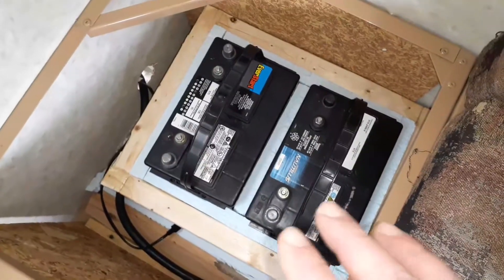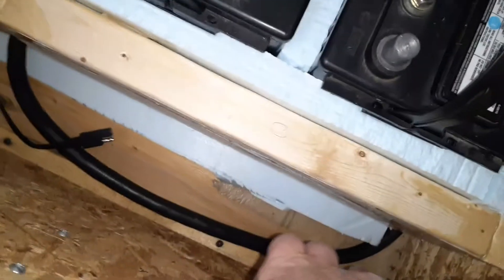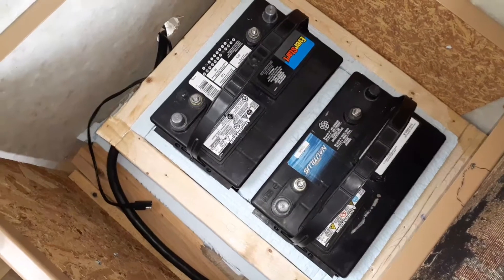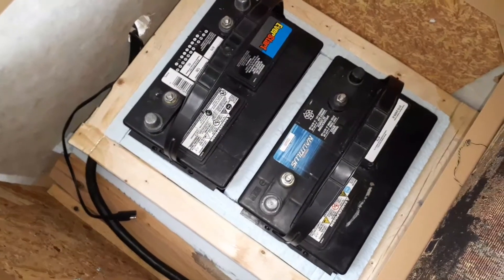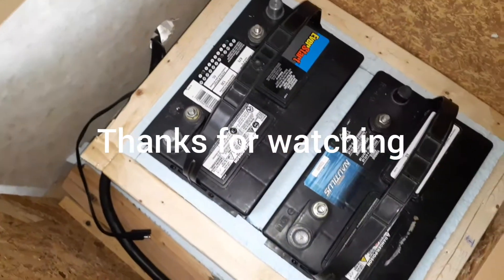I got the insulated battery box in here — it just fit, thank god. I got the two batteries in here, and as you can see, the hole coming in is where I'm going to run my wires through. I have a solar panel wire coming in here right now — the big wire you just have to feed it around and make sure you're not squishing it. The next job is going to be hooking up these two batteries in parallel. If you want to know how to do that, subscribe to my channel — I have a video on how to hook up batteries in parallel. The next step is running the wires from the outside through this hole and hooking up the batteries.